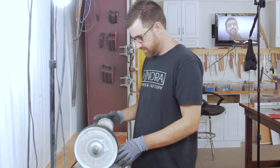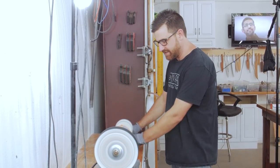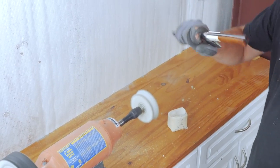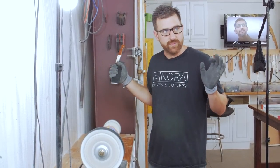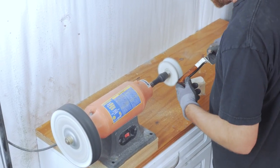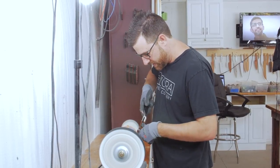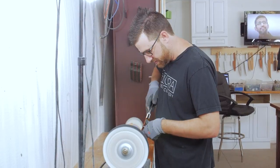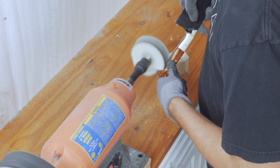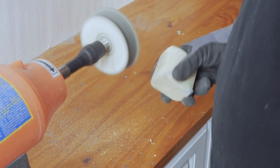You want to start seeing it? Sure. So I fill out the buffer until it has a nice smooth, consistent color to it. The big thing is you've got to hold real tight — the buffer will grab and throw everything everywhere. I've ruined knives with that. I've cut my finger in half. I've had it thrown down and stick in my shoe with a sharp point. So I hold it very tight and gently come in and get a feel for it. I'm looking at the wood itself and trying to get a nice shiny finish on it. You want to keep moving it — if you hold the buff too long at one spot it can burn or melt the plastic and that always causes more work.